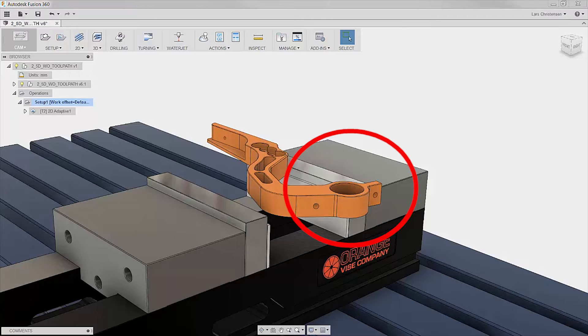The bigger hole in the center is a bushing hole, which means it probably has to be very accurate. I'm actually going to use that as my pickup when I flip the part around — that's one of the tricks to think about. When you have a part and you have to machine the second side, when you're programming the first side, think about how you're going to pick this part up in the second operation. Try to think ahead. What I would do with this bushing hole is make sure it's machined all the way through the stock. I'd probably also use a boring operation or circle milling operation to really give it a good size all the way through the stock. So when I flip it over, I can use that as my X0 Y0. If I had not drilled it all the way through, it would be hard to figure out how to hold on to it when flipped. This is one of the tricks — think ahead.